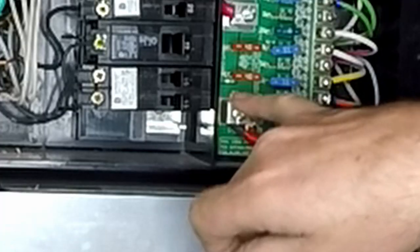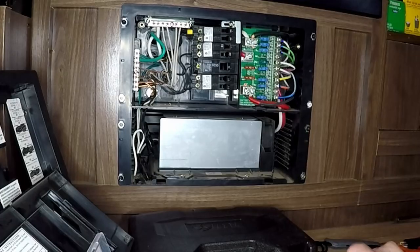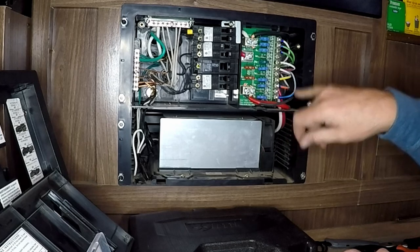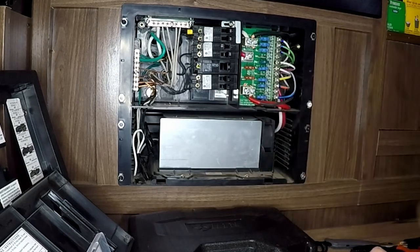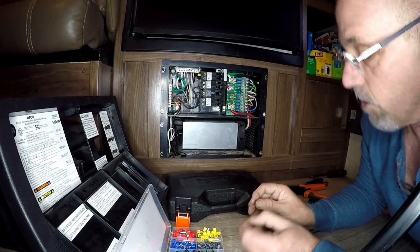I really don't like how they're connected in the control panel. This is actually mine right here, which I'm going to be fixing. If you see me moving that around, you can actually see one of the wires moving — that means it's not a great contact. For the six-gauge, I'm going to have to get some ferrules because I don't have that size available.